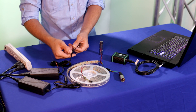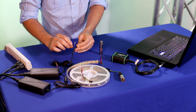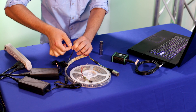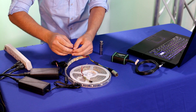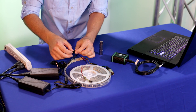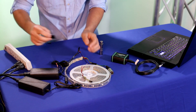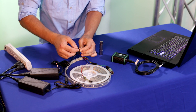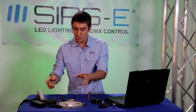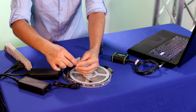In the power supply there are two wires and one of them has white lettering on it — that will be your positive wire. So we will connect the white lettering wire with the red wire on the strip. Make sure your power supplies are off when you are doing this; you do not want to short anything out. We splice both of them into place. This strip is powered on both ends for voltage drop issues, so you will not have any color variations.